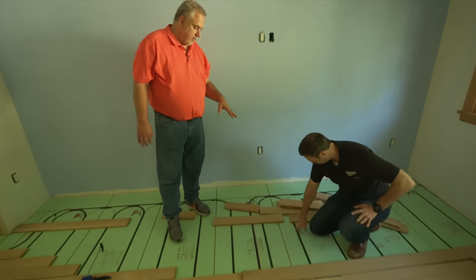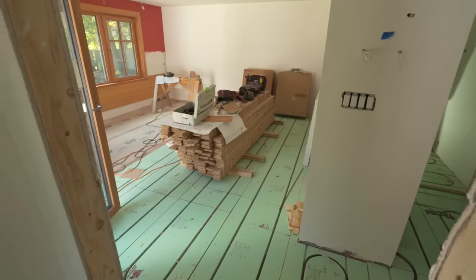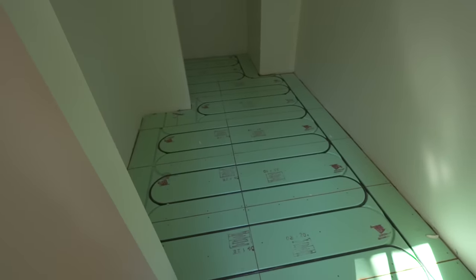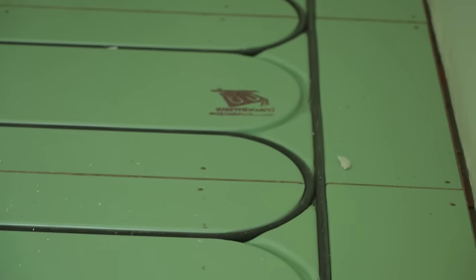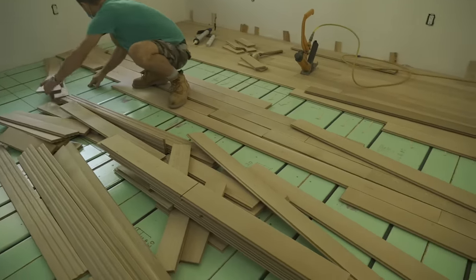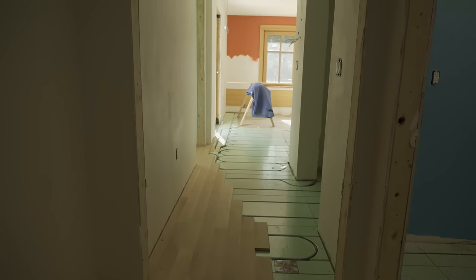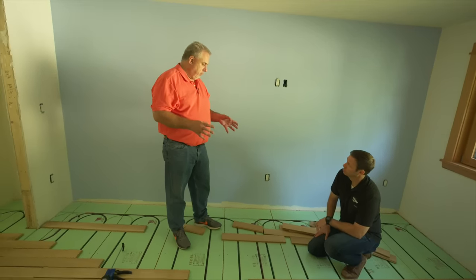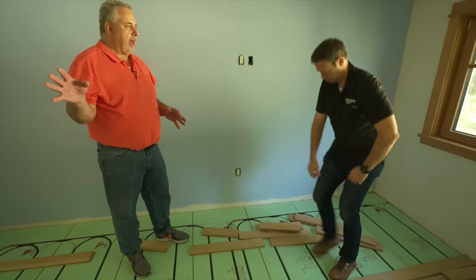You can get those half-inch lines in rolls of 500 and 1,000 feet. But in this particular house, we had a full design. WarmBoard is exceptional at the design and planning stage. They limit loops to about 300 feet because at some point when you charge these lines and put the water through, they're losing heat — you've pretty much lost the heat working in your favor and have to go back and get resurged. They're a solid loop, no splicing. Everything is basically a home run that goes back to a manifold.